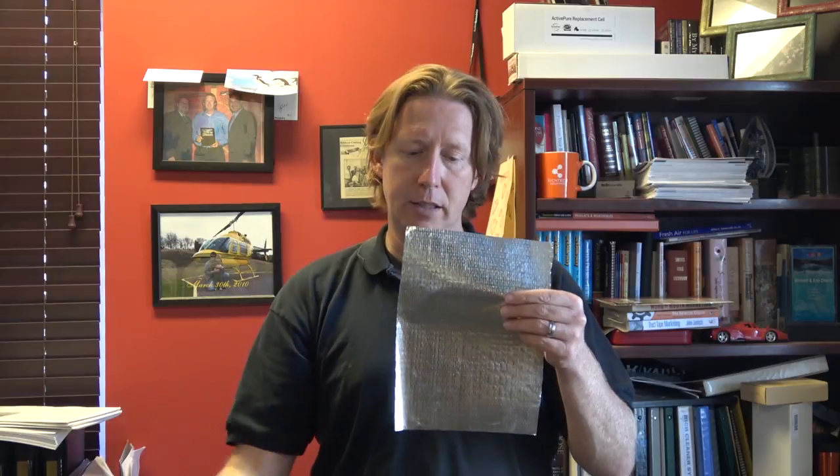That's really nice, because as air is traveling up through the roof decking, it's pulling air and all that hot radiant heat out of the ridge vent or the solar attic fan that you may have installed in the roof. It is not recommended to lay it on the attic floor, especially on top of blown-in insulation or whatever you've got, because even though it is perforated and is supposed to allow moisture to wick through it, it can still hold moisture between itself and the ceiling of your home. If you've got ducts going underneath it, they could condensate, or if you've got a plumbing issue — some people have plumbing in their attic — all kinds of things. So you never want to lay it on the ground.